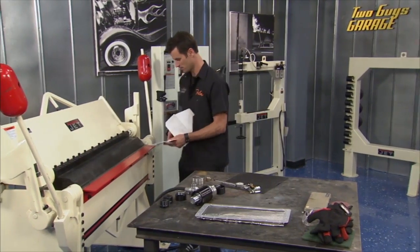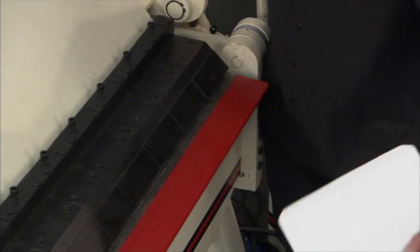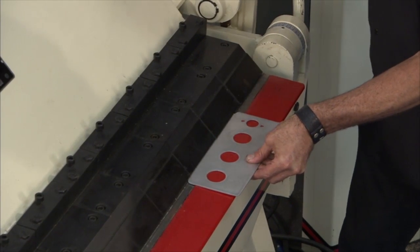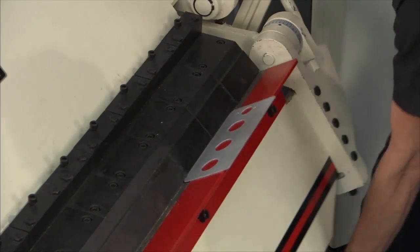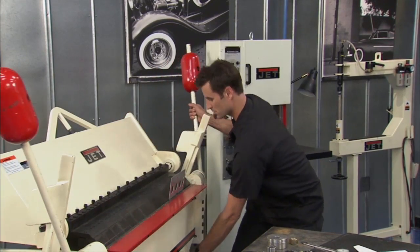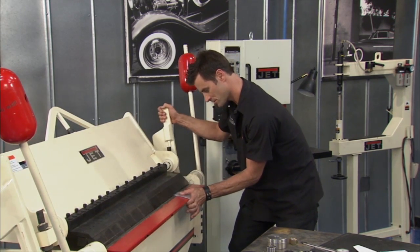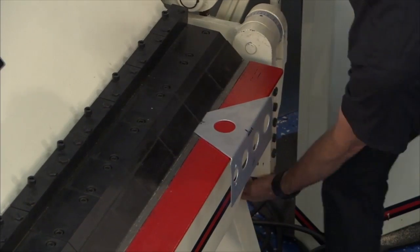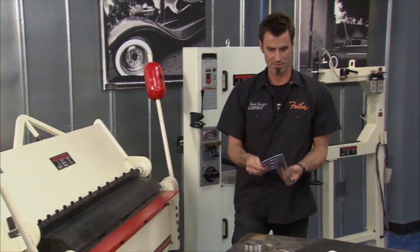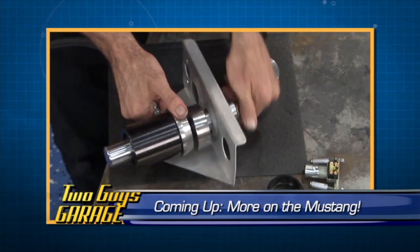If you come over to the brake, a good rule of thumb is take your cardboard pattern and test it first — that's going to work. Now you know your order. Flip it upside down; this is going to be about a 90-degree bend. Go ahead and lock that, bend it over — there's a gauge over here so you can read the angle. Down the other direction, do the same thing. Now we've got one more bend to finish, and we're going to show you how to dimple die — a really cool tool, so stay tuned.